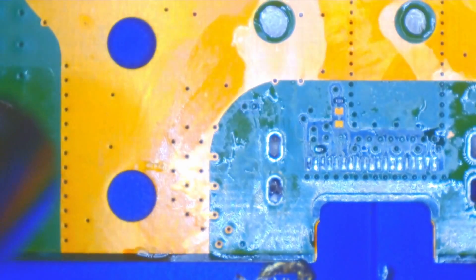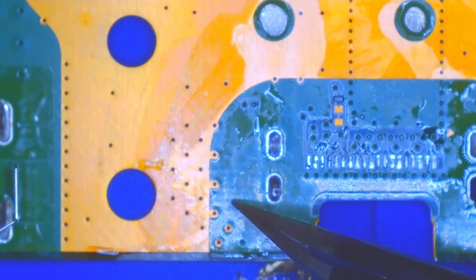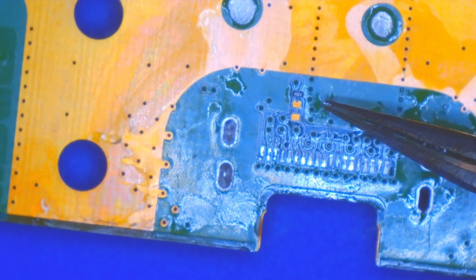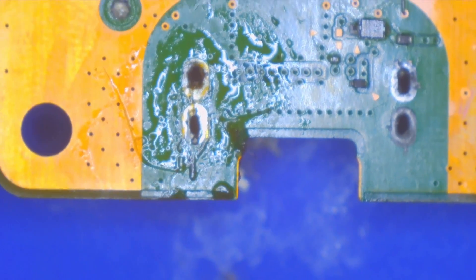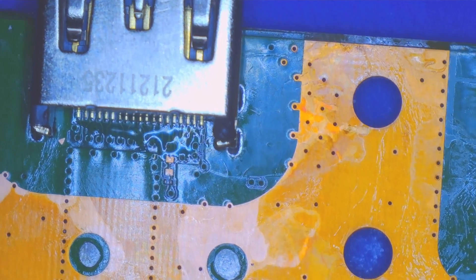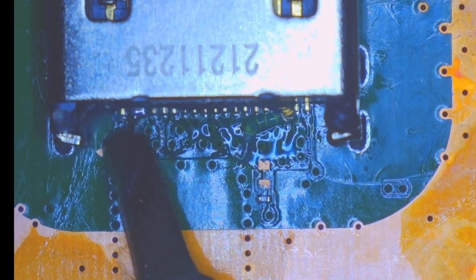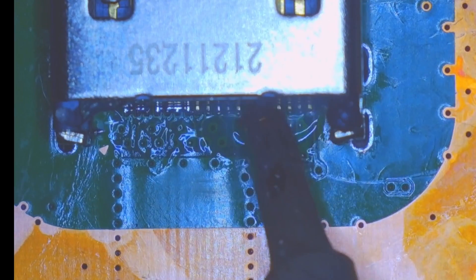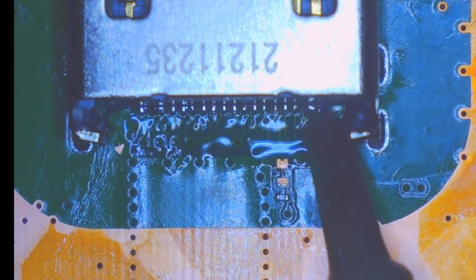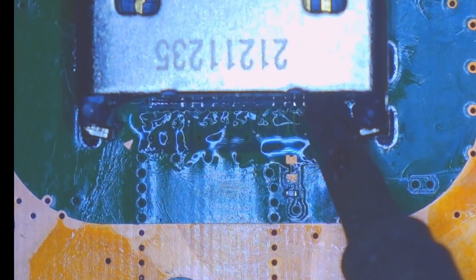Now here's where I'm missing a final piece of soldering equipment — a solder sucker — and I don't have one. So trying to clean out these legs, I used the copper wick to try and clean them out. Here you can see I nicked the little capacitor in my attempt to clean it out and dislodged it from its position, which just adds more work. Luckily that didn't go unnoticed and I found it, because if I had lost that, that would have really sucked. Now with the legs cleaned out, the new port just sits right in place on top of the pads — it's very nice and easy. It's actually a very simple fix to remove an HDMI port. They don't have a second row of connections underneath that you have to worry about, so you can literally just rest it on top and come in and solder the individual legs. That really just takes some flux and some patience.